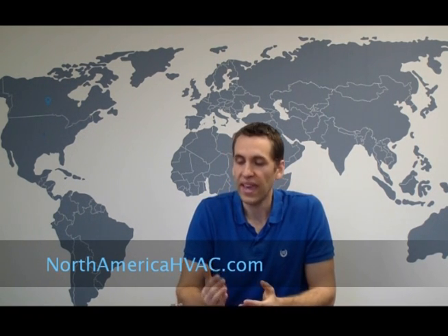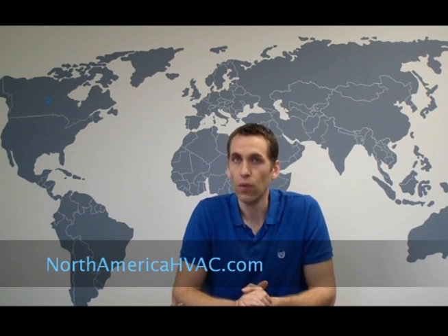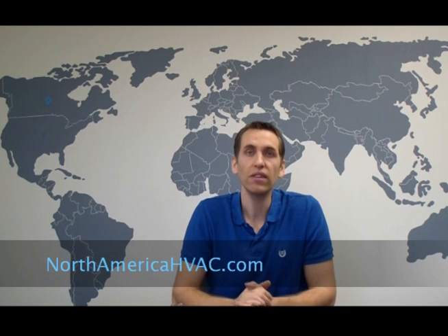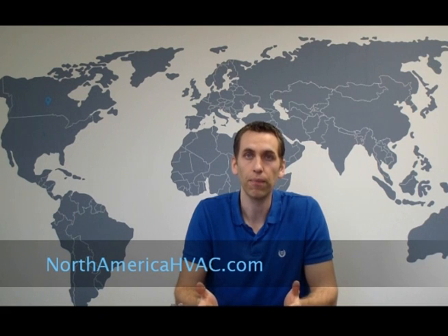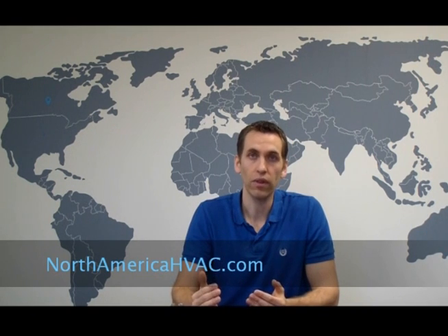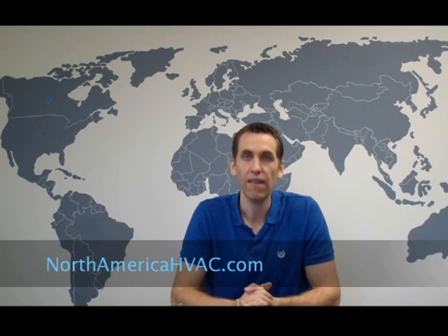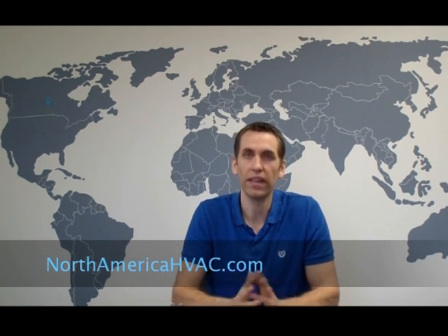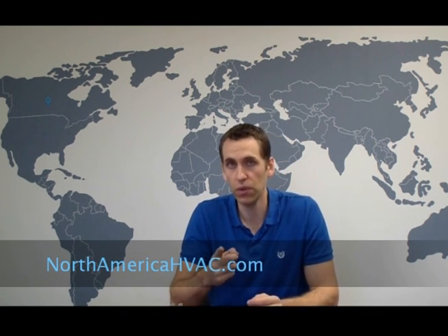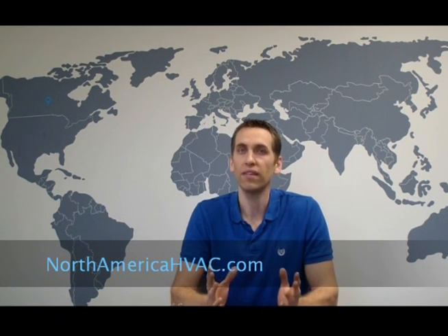Should you change the voltage rating? Here's what technicians do: they only stock 440-volt capacitors on their truck — no 370-volt at all. The reason is two-fold. First, inventory: why stock two capacitors when one does the same job? Second, the increased cost to the consumer is usually only one to four dollars when upgrading from 370 to 440 volts. For the bang-for-the-buck, it's just better to get the 440-volt capacitor. So do what the technicians do — get the 440-volt and make sure you don't have to go through this process again too soon.